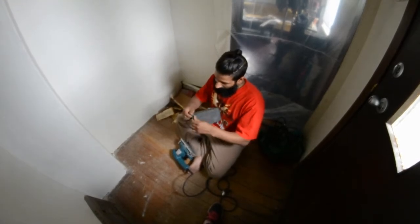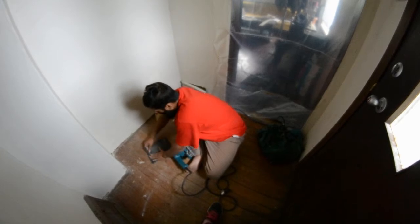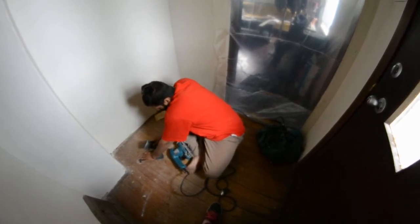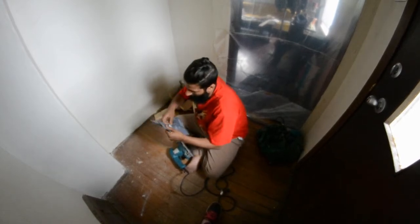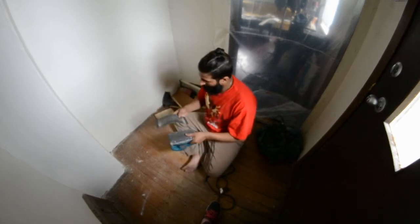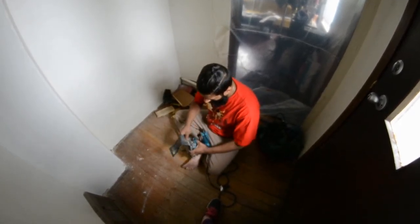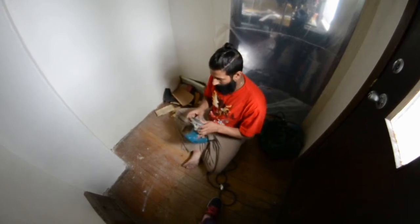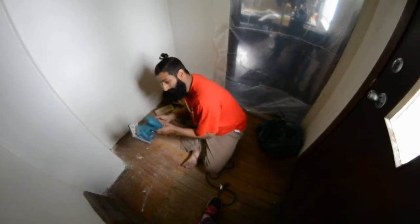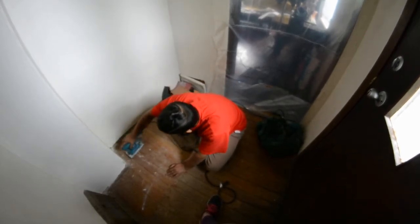So what I'm going to do is rip this sheet here so that it fits. They're usually ripped into thirds. This stuff is actually really hard to rip, but this one I've already used, so I might put it on and get full use out of it, because it is not quite used 100% yet. So I just install the paper, and I'm not going to turn this on now, but I'm just going to go with the grain, and I'm going to keep this as level as I can.